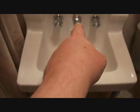The drain pipe for this guy goes on a diagonal over like that. He probably turns and goes into the drain stack, which is right here. You know, it just goes in over there. So you have a Y and a T for the toilet and the bathtub, and then above it you have a T for the sink, which is right there. So this wall is so uninsulated. You might as well be outside. It's so friggin' cold in the winter.